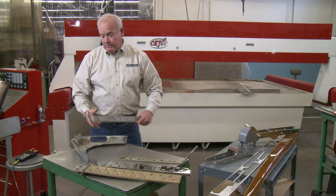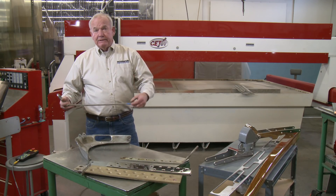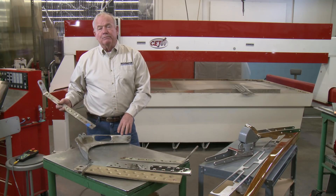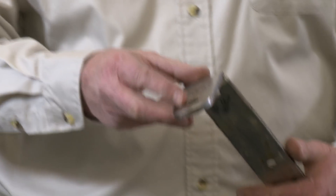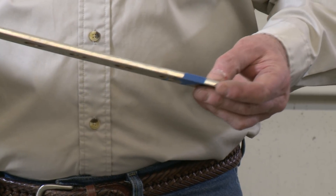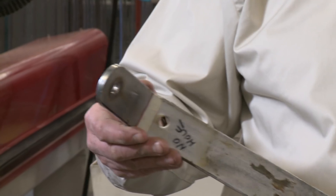Because it's so difficult to replace or repair, we've decided to replace the stem head fitting with a fabrication that is smaller, has a tack fitting on it on deck, and a small roller for an anchor. In the Bay Area because of the tides, if we're going to race it up there, it's often the case in light air that you have to anchor. This boat is 50 years old — this stuff is worn out. The holes in the old stem head fitting are mushroomed out and worn, indicating they've been overloaded. There's bleeding of the material and corrosion just below the tape — dangerous because it could be corroding inside. So the decision was made to definitely replace all this.